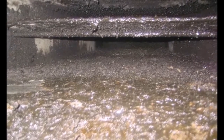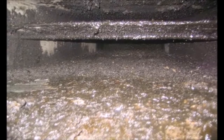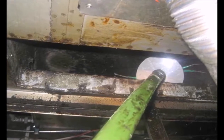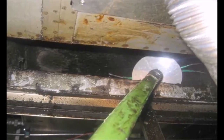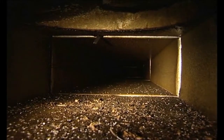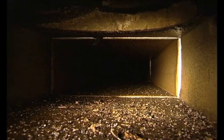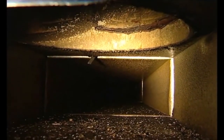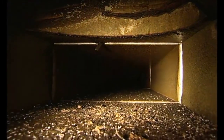Also, there are several different types of duct configurations for grease extract systems. First, hand scrape the first half a meter in order to determine the amount and construction of grease layers. If there's a lot of grease, more than 0.5 centimeters on the duct surface, you need to be aware of the distance between the access opening and the vacuum unit, because if you exceed the critical amount of greasy mass, it might be difficult to get greasy granules out once they get stuck in the tar-like bottom in the suction end. It's always best to scrape as much as you can from the suction opening also, and limit the maximum length to approximately 8 meters, so that you can see what's happening.